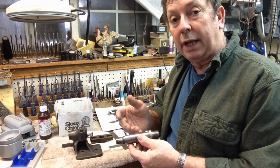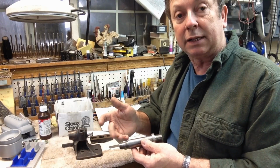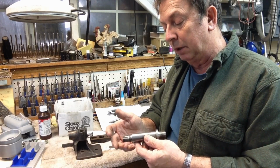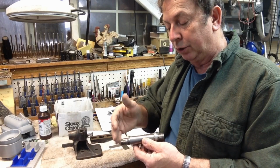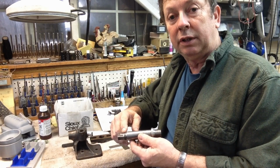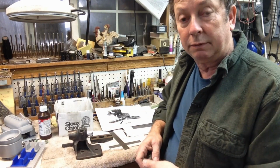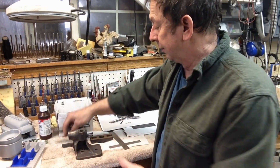I'm surmising what Atlas did is they developed a 6-inch lathe, and I would suspect it was developed before this set of index centers for the mill was developed. But all they did was take that spindle out of the 6-inch, shorten it up to whatever length it was here, and turn and thread it to adapt to the headstock. The rest of it, its origins would have been in the 6-inch lathe spindle. So that's the way that is.